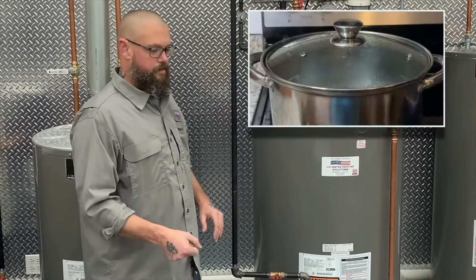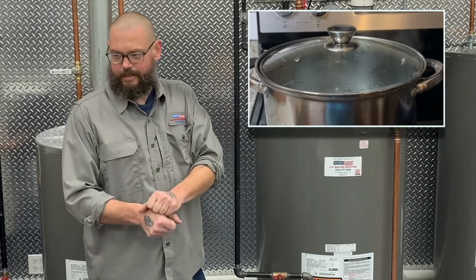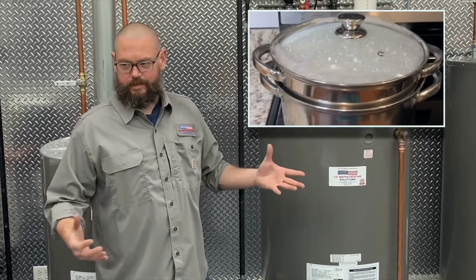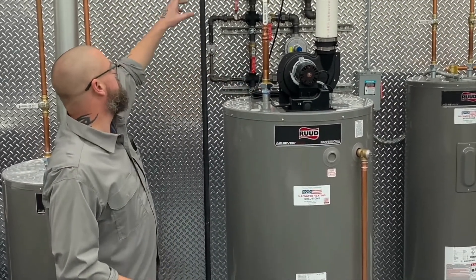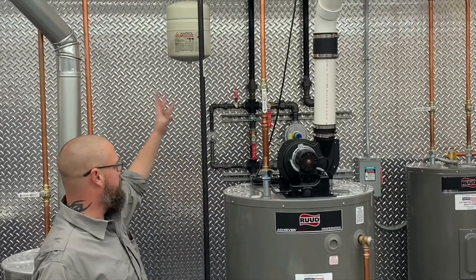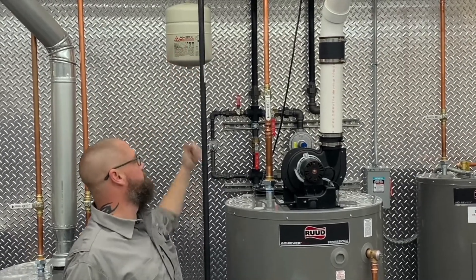It's like putting a pot on with water and putting the lid on it — that is going to expand where you have nowhere to go, so it boils over. Where that extra energy goes is inside this tank. As the water heater heats up the tank, the bladder expands towards the back of the tank, relieving the pressure.